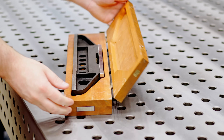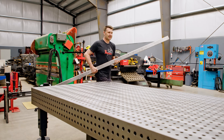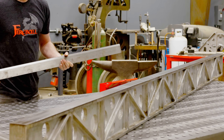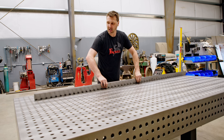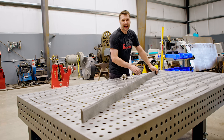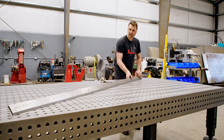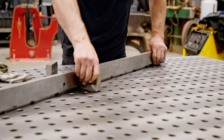Let's go with one more approach. It's amazing how many options you actually have to dial this table in. This is an eight-foot precision straight edge — around $800 — but it's probably your next best option besides a super long precision straight edge. What you want to do with the straight edge is go corner to corner. The straight edge isn't going to tell us that we're level — it's going to flatten the surface. I would rather have a flat table than a level table. You go from corner to corner, check the teeter-totter, and stuff shims underneath. The straight edge needs a helping hand or some magnetic blocks to hold it on the diagonal.